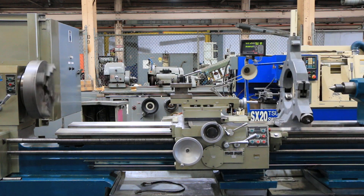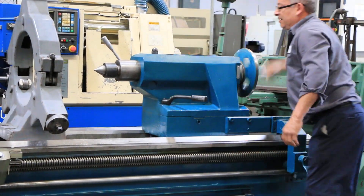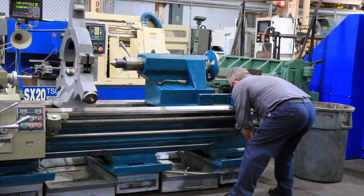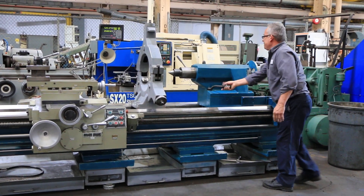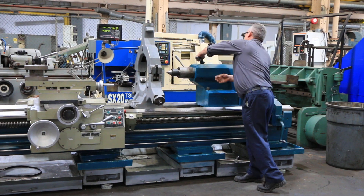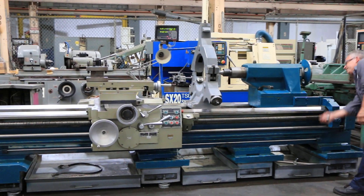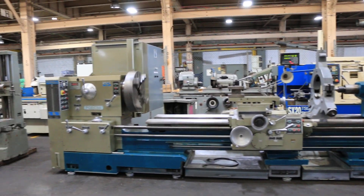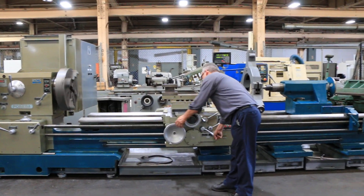You've seen the thread, you've seen it feed. That's the tailstock quill. That's your tailstock, actually the whole base, moving it on the rack. You saw the quill move, you saw the tailstock move in its entirety. The tailstock is a number six Morse taper, by the way.